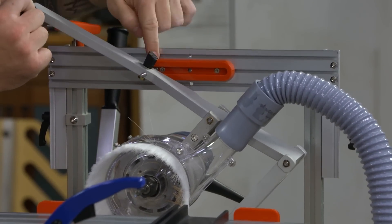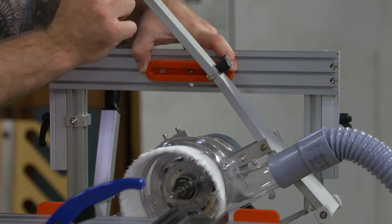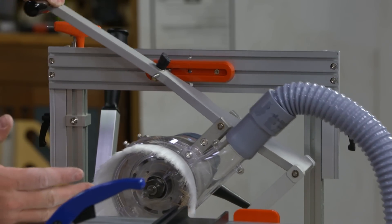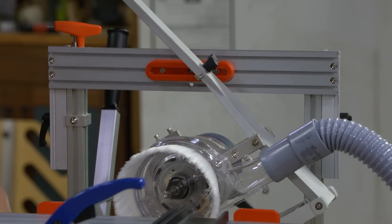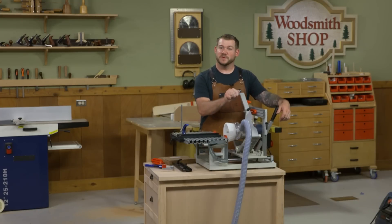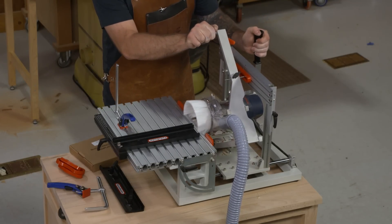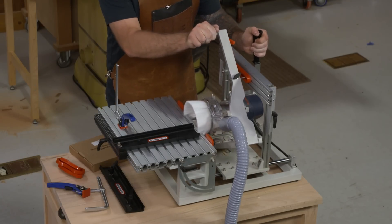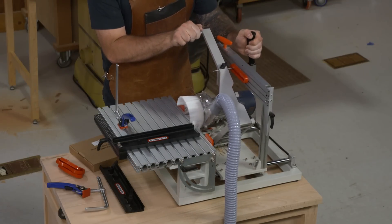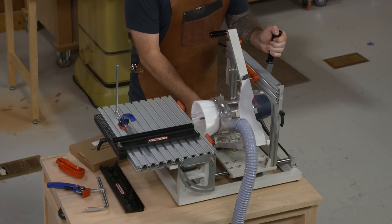This particular template is two and a half inches, which means the template itself is five inches long, reduced down to two and a half inches at the bit. In this orientation, I'd be making a slot or groove that's two and a half inches long. The Panto Router has two levers - one controls router movement back and forth, and the other controls lateral movement into the workpiece for depth. Two levers for two hands, allowing you to make plunge cuts and follow a template to create shapes.